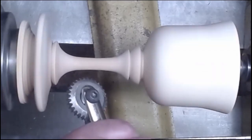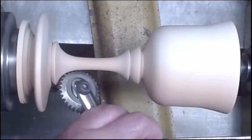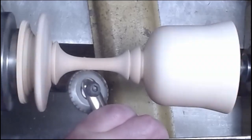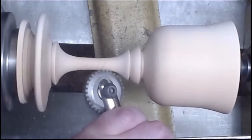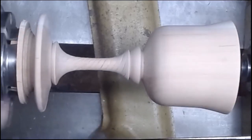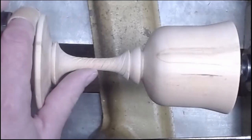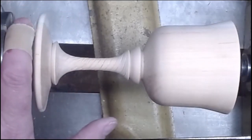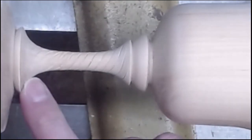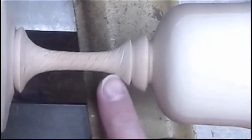You're going to love this. I want to engage the teeth — I'm only cutting with the top of the teeth, being real careful about where I start. I'm going to start it there, let it start running, and then slowly move it down the length of the goblet until I get here. There you go — can you guys see that? I've got some real good spirals in there and the platform keeps it indexed.